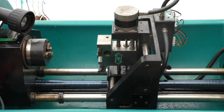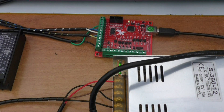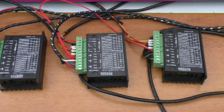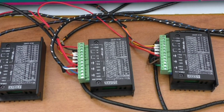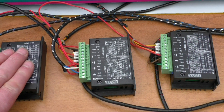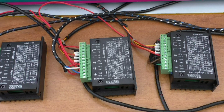The next job I think is now the proximity sensors and we'll leave the spindle motor until last. Quick overview of the wiring: we're starting with the CNC breakout board for Mach3, a 12-volt 30-amp rated power supply, then we've got our three TB6600 stepper motor drivers. The leads from the back of the lathe are quite long so they've come straight out. This is all a temporary setup just to test things — the drivers are running a little warm and will need a heat sink.